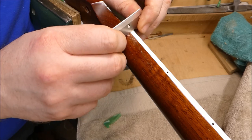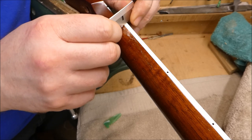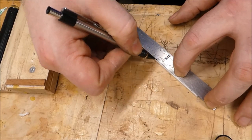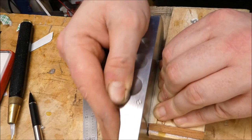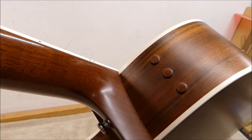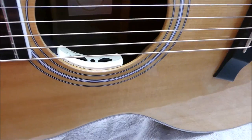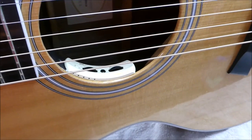I'll scrape the super glue squeeze-out flush and then sand and polish the area of the repair. With the addition of the under-saddle pickup I need to reduce the height of the saddle slightly to account for that, so I'll mark it out — this stuff is soft enough that I can use a hand plane to rough off most of the material and then get at it with a sanding block. I've got those plugs in there, I think they look alright, and the Anthem is installed. I managed to get all the wires to behave — that's always a fun part of the process working with those tiny little fold-over clips and making sure nothing's flopping around in there.